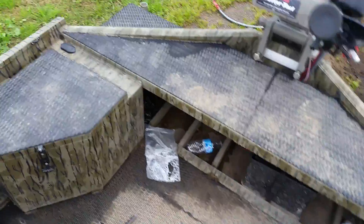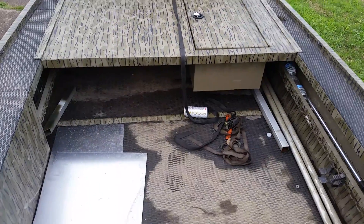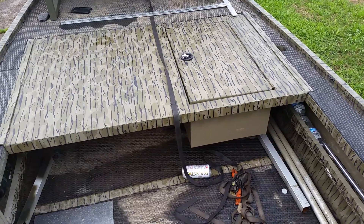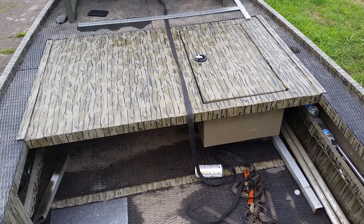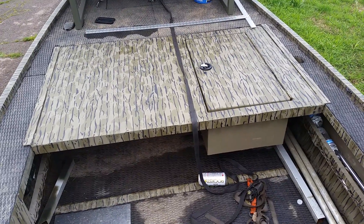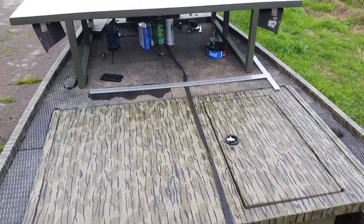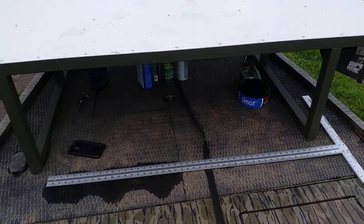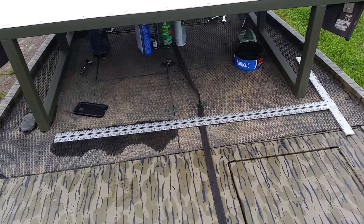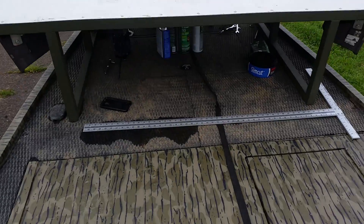So that's kind of the theory of why we're doing the things we are — trying to maximize efficiency and you've got to keep things lightweight. When you're planning how you're going to do these things, weight is a factor. You don't need that heavy of material. That thin box tube, properly gusseted — Mark and I together weigh 400 pounds and I guarantee we can put 800 pounds on there and this thing's not going to budge. Less is more when it comes to bow fishing.